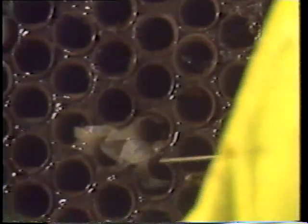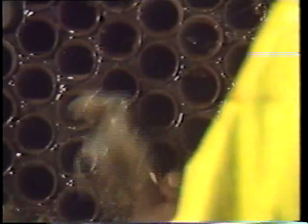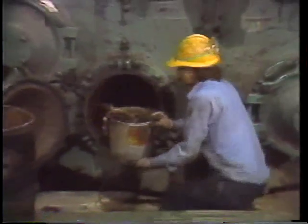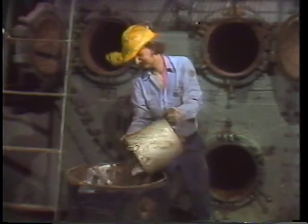Be sure to use care, though — some tubes are made of soft metal and you could damage them. Bristle or wire brushes may be used later to get any slime accumulation from the face of the tube sheet. Once the tube sheet has been picked clean, the workers make a sort of two-man bucket brigade, passing all the crud out and dumping it for disposal.